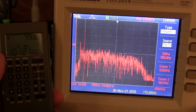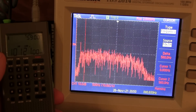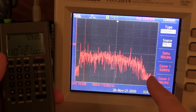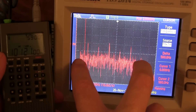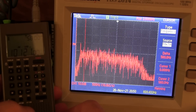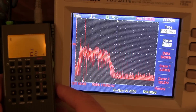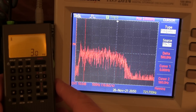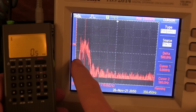I always find it interesting to visually see what the bandpass filter is doing. I've got the audio output of the radio wired into the scope, showing me the frequency response or FFT from DC out to 5 kilohertz - about 500 hertz per step. We're looking at the shape of the filter at the 4-kilohertz widest position. By clicking the filter button and rotating the volume knob, we can scroll through the various filter shapes: 4 kilohertz, knock it down to 3, then 2.2, then 1.2, and then 0.5 or 500 hertz.